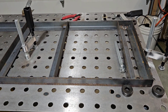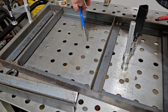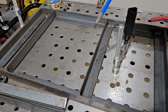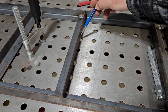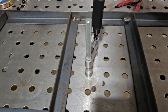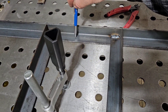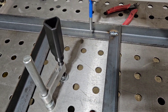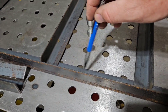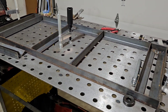All right, so I think we're at a stopping point here. This frame is going to have mounting points here and here — those are plates that I'm going to have to cut and weld on. I put an eighth-inch gap in here, so another plate here and another plate here. The trucks hang off of those plates. Also, right in here, I have to drill a hole here and here for the pillow block bearing. Same over here. The pillow block bearing is in the middle for the jack shaft.